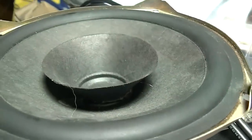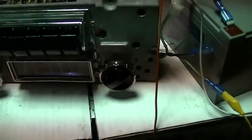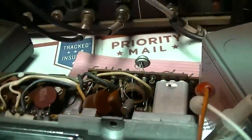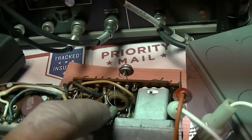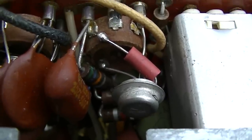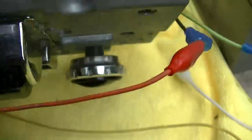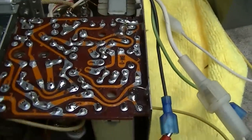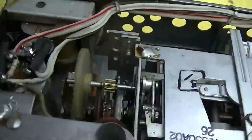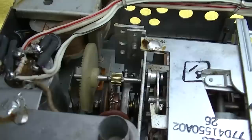You can hear there's a lot more noise now, and even some DX starting to come in. I like this transistor a lot better. It's just going to be about figuring out how to get it in there — I might not even pull the circuit board out; I might just tack it in from here. It's actually soldered in really well. I chose not to pull the board apart at the risk of damaging something. Also, this has been cleaned up and new capacitors have been installed — a couple here and a couple on the other side.